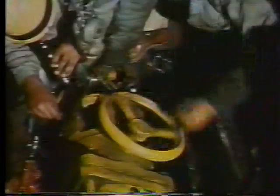With the sphere joined, its stud nuts were run up inside the shaft and each was tensioned to 950,000 pounds by means of a power-driven wrench procured just for this job. It was now possible to start erecting the telescope.